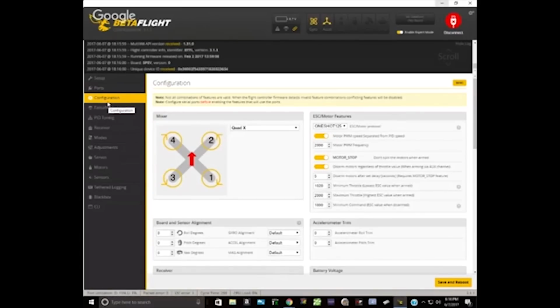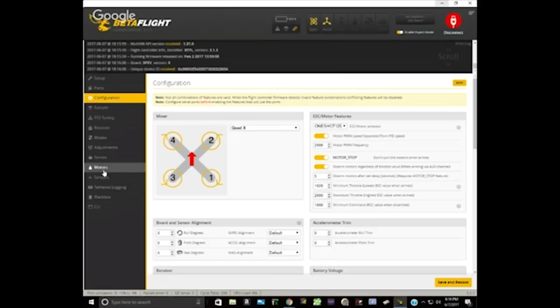Now, the next thing I noticed is that when you raise the throttle with the motor spinning, the quad kind of oscillated on the yaw axis. I think it did. Yeah. It has a sharp jolt. Yeah. And that suggests to me that if there was one motor spinning the wrong direction, that would do it. I wonder if you've got a motor spinning the wrong direction, and that's why it's sort of trying to flip out. I've checked these things quite a few times, but I went through these things. I believe you. Yeah, probably more than once, but I just couldn't believe it. But we'll check it again.